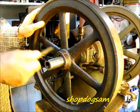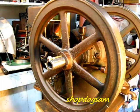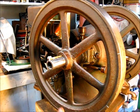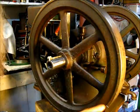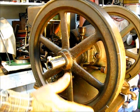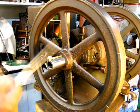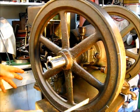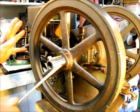I will have to fit a key to this shaft and flywheel. I pretty much found out that there's no two of them alike if you take them out of original engines. The flywheels that were on this engine were so crooked and bent, something was out of place. As I was going through flywheels I found these two right here that were just within a matter of a couple of thousandths of running so true, I decided to use them on this engine.